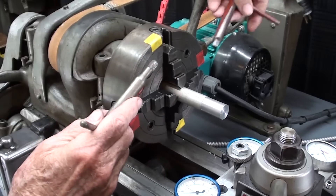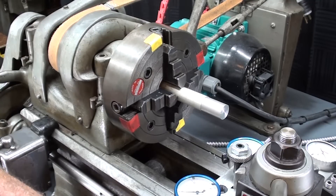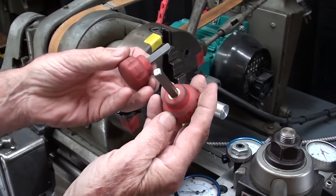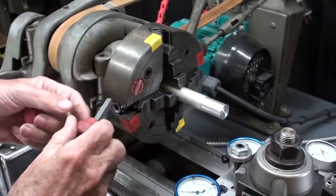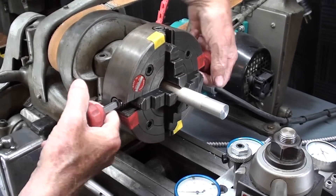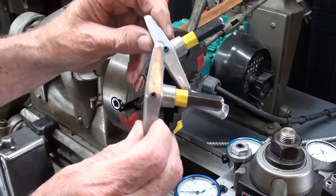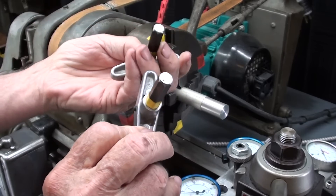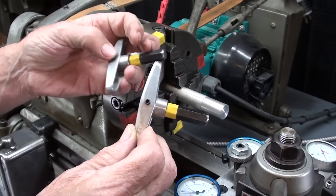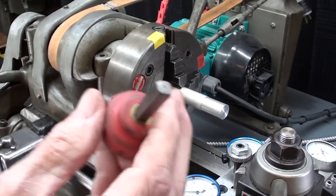These are a little bit clumsy because they interfere with the bed of the lathe and this lever right here, and other things. So over the years I have made several sets of these knobs — this is just quarter-inch square in some scrap knobs. I don't know where I got them, but that just works perfectly. I have made other sets over there — there's a hexagon set for one of my other chucks, so this might be a good project for you. Pretty simple; they do not have to be hardened, although these are Allen keys, but this is just soft steel.